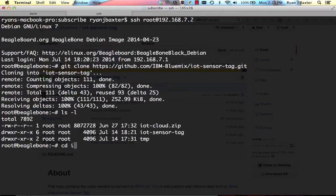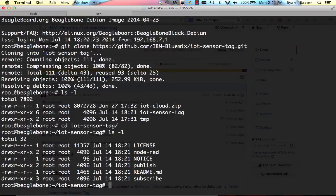If I cd into the IoT sensor tag directory, there are a couple of directories in there. There's a Node-RED directory, which we'll come back to, a publish directory, and a subscribe directory. We're going to publish data from the Beaglebone Black to the IoT cloud, so we're going to cd into the publish directory.